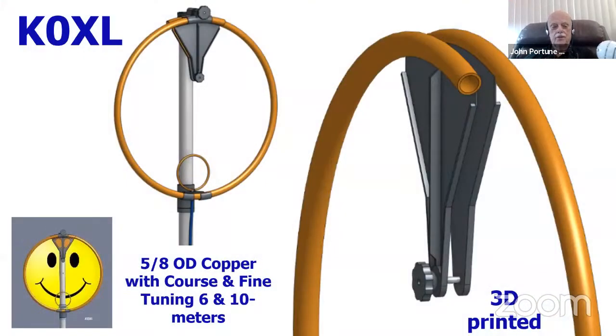Good friend of mine, K0XL, was building this really great mag loop out of 5/8 copper tubing, which is sufficient for 6 and 10 meters, not big enough for lower than that, but at least big enough for 6 and 10 meters. He was 3D printing this nice little tuning capacitor to go at the top, which basically brought the two copper pipes together, which overlapped to give them some capacity. And then he had a copper surface on the two plastic printed pieces there, which created the tuning capacitor, and then a little knob at the bottom there so he could do the tuning with it.